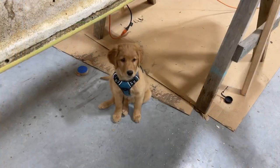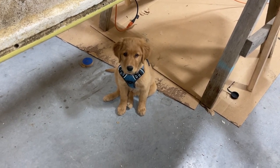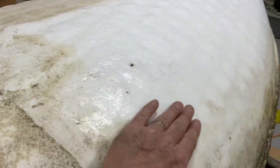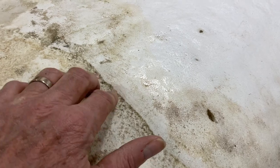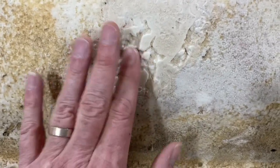Alright, we're glad you're here, let's jump in and see what kind of progress we can make today. Something I'm noticing is where this yellow plastic was over this — obviously this has been protected and it's much nicer. There's a ridge right here where the plastic ended, so we've got a lot of fairing to do. There are moon craters in this thing still, but where we started out with foam we got the big holes filled in — that's going to take a fair bit of fairing compound to smooth that out.